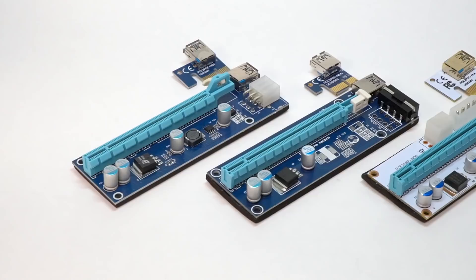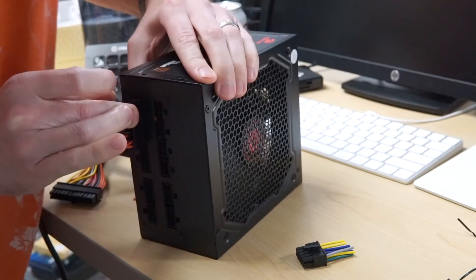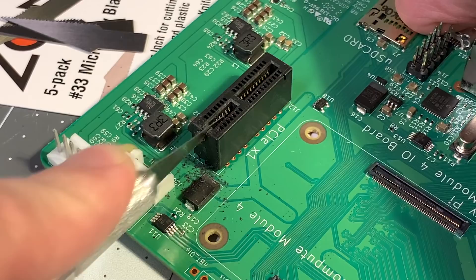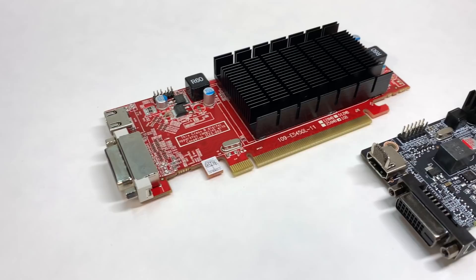Since that first video, I also did more testing with various power supplies — not only in external powered GPU risers like these, but also with higher current power supplies on the I/O board itself. I used a 600-watt PC power supply, then managed to blow it up making a custom power jumper. Then I used a 700-watt PC power supply, and that still didn't make any difference. Power was definitely not the issue. I also bit the bullet and sliced into my precious PCIe slot using a razor saw. Now I can plug 4x, 8x, or even 16x cards straight into the I/O board, so I know the 1x to 16x adapter isn't the problem either.